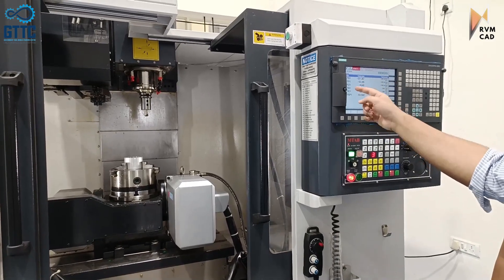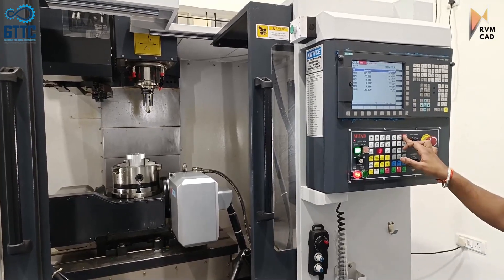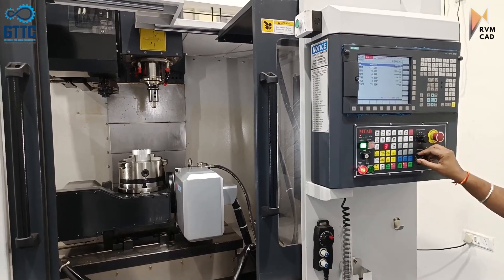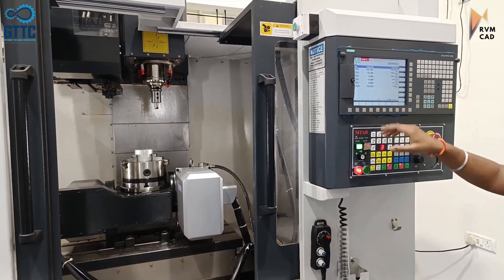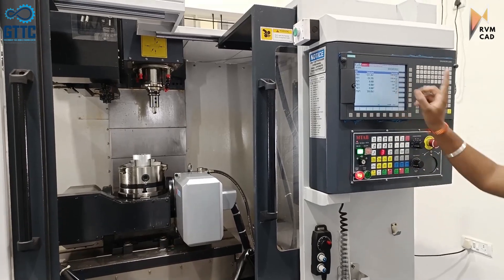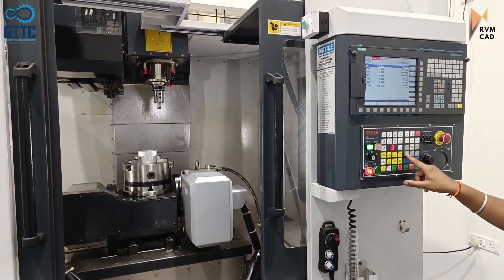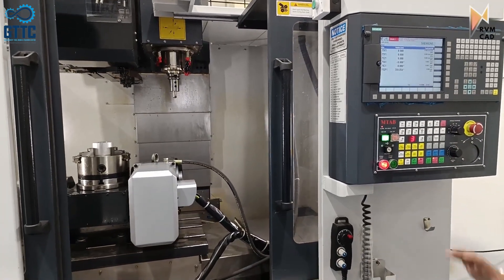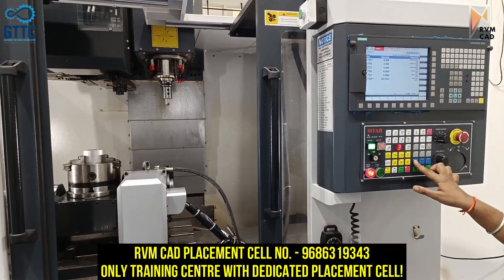The axes are: X, Y, Z, and A and C are the angular and circular axes — these are the 5 axes. MSP is the spindle. For referencing in milling, we start with Z — Z referencing becomes 0. Next, Y axis — it is moving. Then X axis, going to the reference home position. Next, the 4th axis — some alignment should be done. Now it is 0 according to the machine.